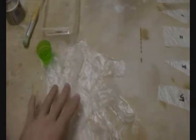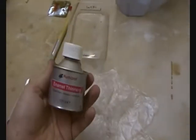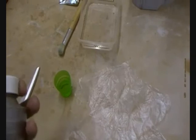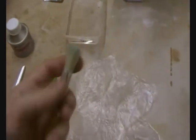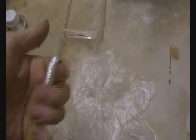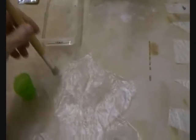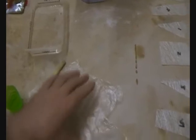It's going to be quite a tidy process here because of the amount we're mixing. This is just to top off a washing up liquid bottle, so I can put some cellulose thinners in, which is this stuff, so I can clean the brush after I've finished using it, so I don't throw the brush away. The brush itself is quite thick and short. I have cut the bristles down to make it easier to stipple in between the fibre mat when we come to use it.